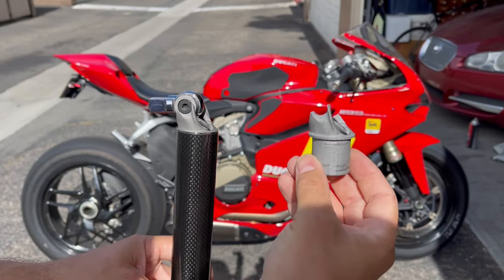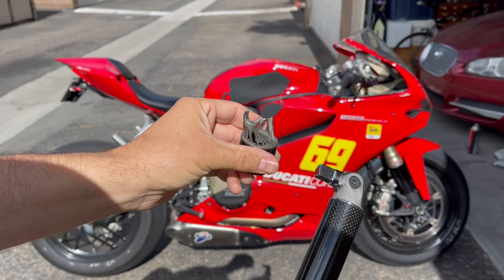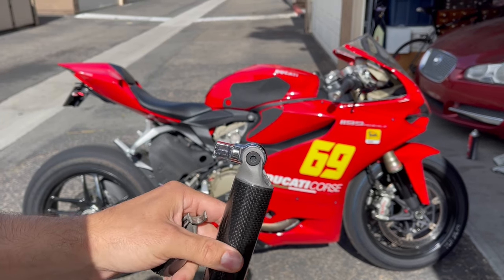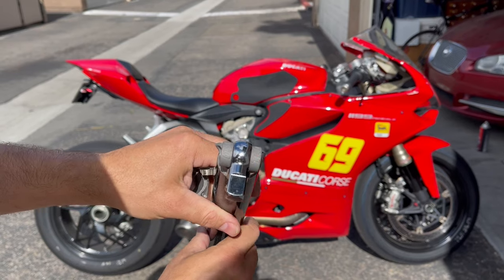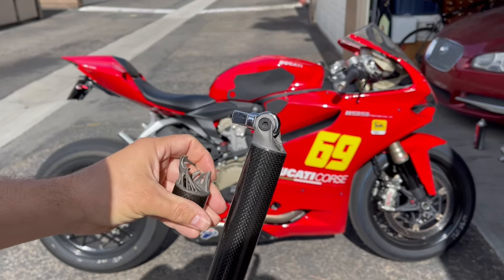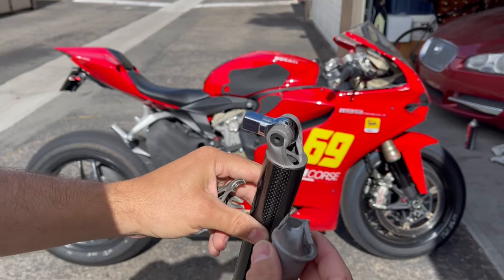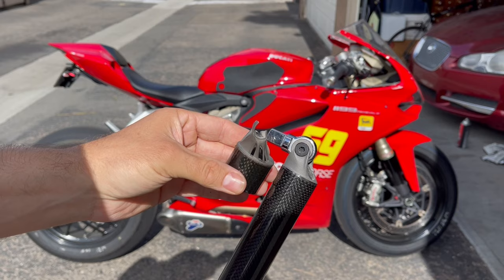We went through first iteration aluminum, second iteration titanium grade 5, third iteration tool steel — which I modified the design slightly to help it work — and it finally worked. I would say definitely run FEA before you go ahead and print anything from Fusion 360, because the generative design output alone just doesn't seem like it could ever reliably work.